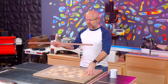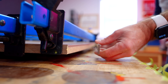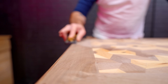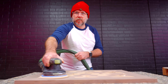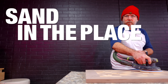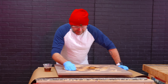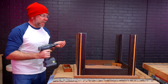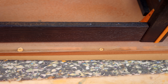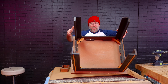Now I'm going to get some edge banding on this tabletop — just using some solid walnut strips that we're going to cut to length. We've got to fill in some of these knots with epoxy. This is my favorite moment of any project. I look so good. Last thing I've got to do is screw it back to the top. As long as you don't look underneath it's going to look handmade — you can see where the old screws went into this chipboard particle board. We used all the same screws — very resourceful.